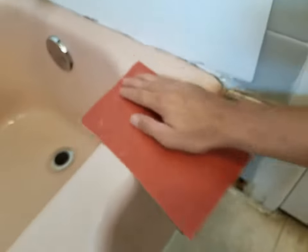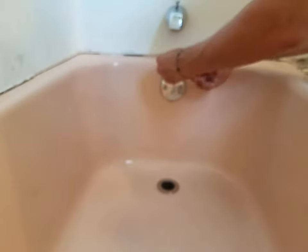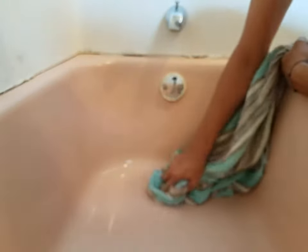The next thing you'll want to do is sand down the tub so the paint has traction. I recommend removing the fixtures, but in my case it benefited me more to just tape around them. You'll also want to make sure your tub is 100% dry — I had a little drip from the faucet, so I had to dry it again and ultimately wrapped it up in a plastic bag and rubber band.